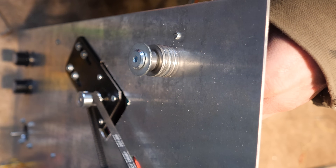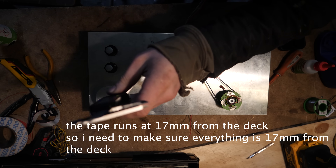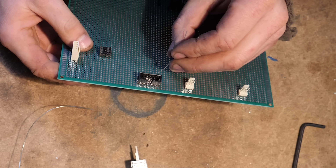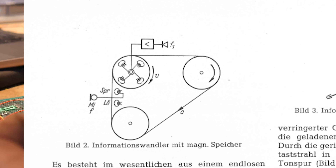This is the first time I actually got it spinning around - I was elated because it actually seemed like it was going to work. This is a bearing with loads of washers so it feeds the tape and makes that angle. It's very important to have a 90-degree angle so the tape heads don't actually cross over each other, which would mean the tape heads are reading from two separate bits of tape at the same time. At 90 degrees, you'll only ever have one tape head actually reading the tape at any one time, so the effect works.